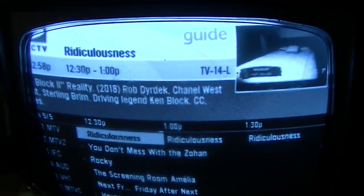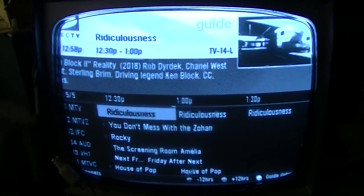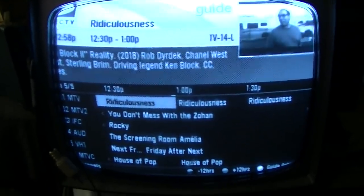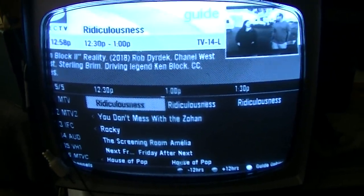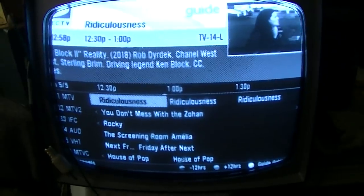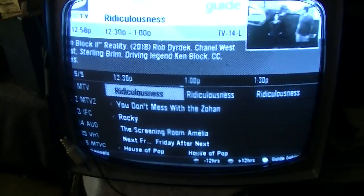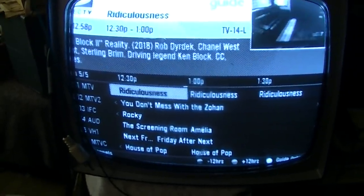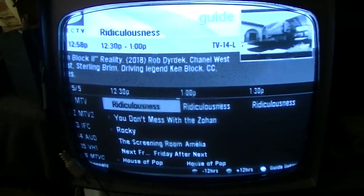Okay, that was with the audio just directly into the amp, which there's still a regulation problem and a bit of hum here, but you can see going in with the composite video, I still got the detector diode pulled loose. Just incredible picture. There's something in the IF that's screwed up. So next video, we're gonna figure this thing out.